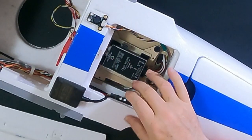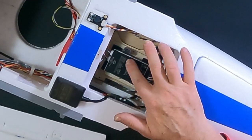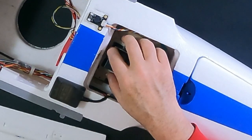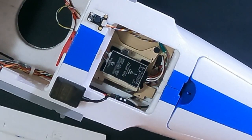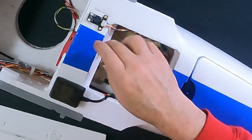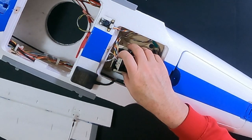On the power distribution side, I have UART four — normally a GPS port, but since I'm using CAN for GPS I have two free UARTs. UART four is running ExpressLRS, and UART two is running the connection to the Raspberry Pi. The last thing connected on the front is the safety switch — I've put it here temporarily; I want to figure out the best placement once I have the wings on and motors installed.